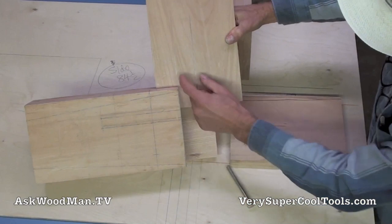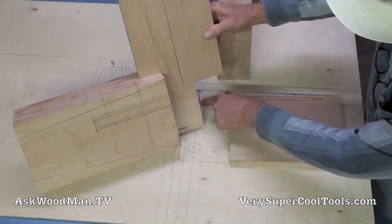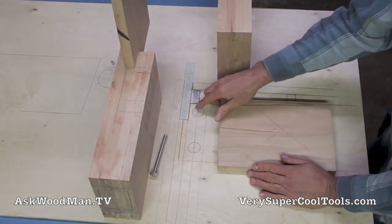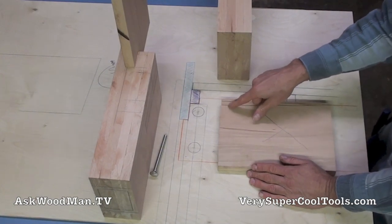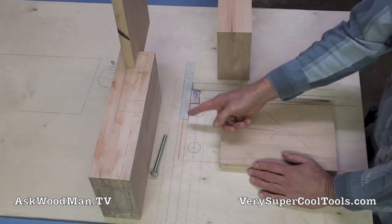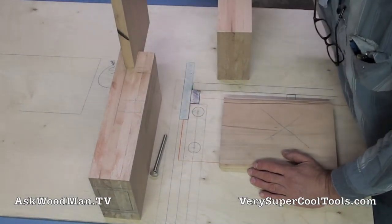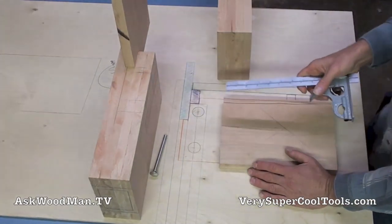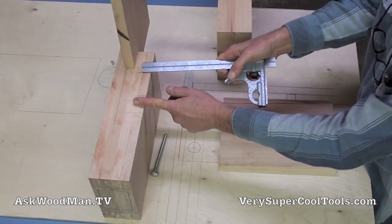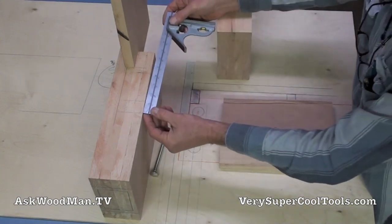This drawing right here represents the slat rail — this purple — and this represents as high up as the connector is going to go, which is right here. What I realized is if I drill through here, that's going to really short-grain my piece right here, and I don't want just that little bit of short grain left. So I've moved my hole down to right here. Since this part is coming all the way back in here, two and a quarter inches is what I'm going with — two and a quarter inches back — so now I've got all that extra mass on the other side. This piece is seven and three quarters.